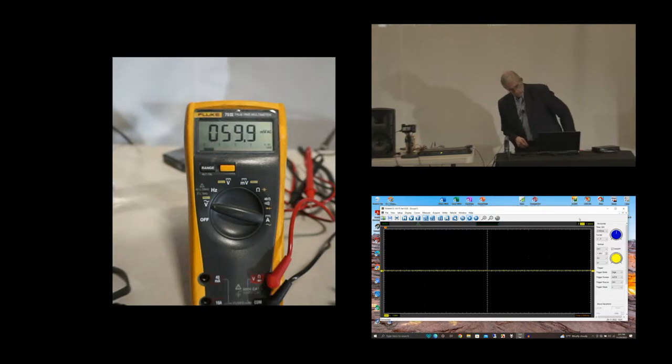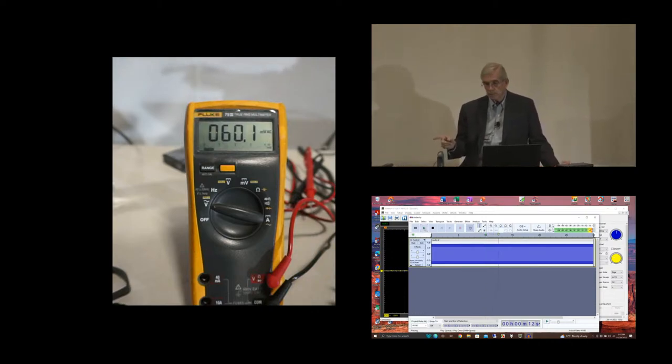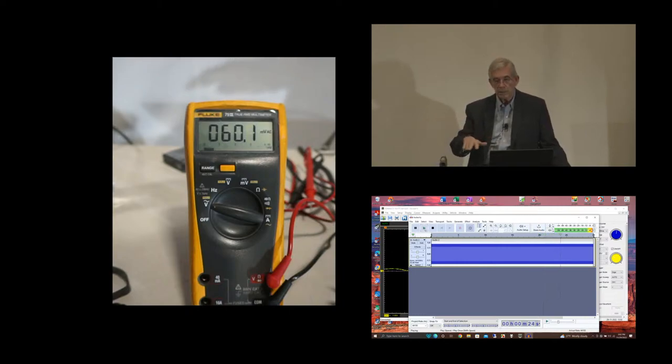And if I go in and generate a different one, I'm going to generate it at 180. And again, you can hear the 180, okay? Now the significance is that the 180 is far below the crossover point. So when I play this, nothing is coming out of the horn, it's only coming out of the woofer. Because the crossover is telling it, if you're playing this frequency, come out of the woofer only.